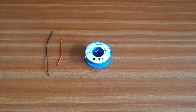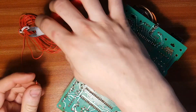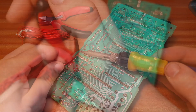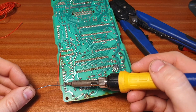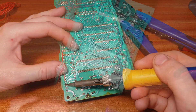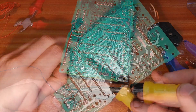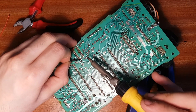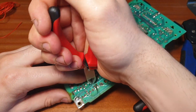So what do we do about it? Two wires, solder, and a smug sense of 'I can do better than an engineer.' I'm adding two solid core wires that act like traces, connecting them to decent sources of power and ground. I could have wired these directly to the UAV, which some would recommend for video clarity, but doing it this way means the CD4050 will always have a good connection to the power rails even if I remove the UAV.